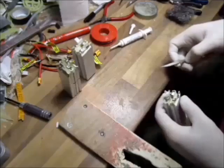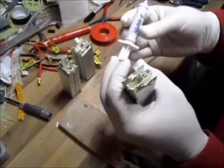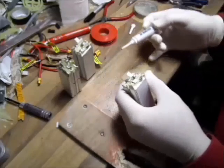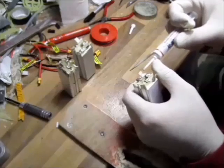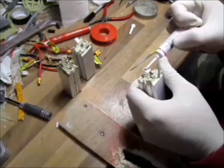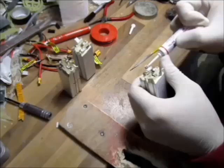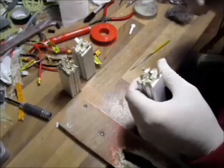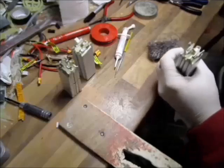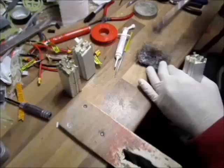Now I don't have a spot welder. That's about time to make myself one. So basically, I'm using solder paste for aluminium, where there cannot be any flux or anything. The solder iron has to be clean, and all you have to do is heat it up, and this piece becomes a solder joint basically. Now it's tricky with the battery, not to overheat the battery, but I did it before and it worked. Clean.